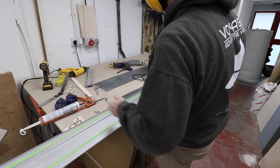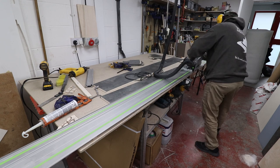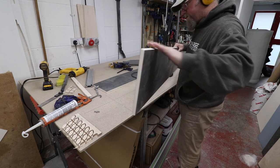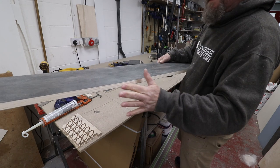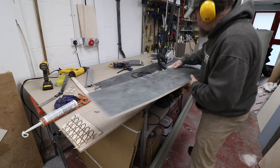Just got to adjust the angle to take the chamfered edge in as well. That one's now chamfered at about 10 and a half degrees on this corner - it's a slightly abrupt corner now, so I'll just wipe it over with a sanding block.